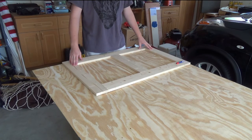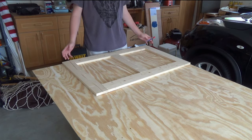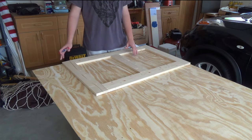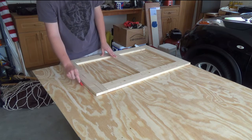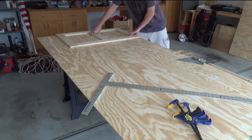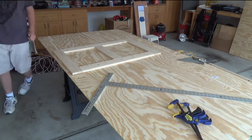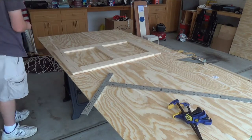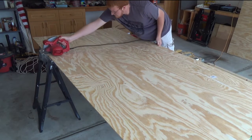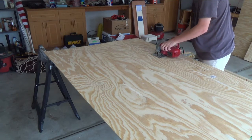Now that I have a few of these panels made up, I'm going to put them onto this quarter inch plywood. Along all four sides, I have about a quarter to half inch extra, because I want the edges to be perfectly flush. I'm going to leave a little bit of an overhang so that I can use the router to square them up. So I'm just going to take this crown and draw a really rough line, then cut it out with a circular saw.